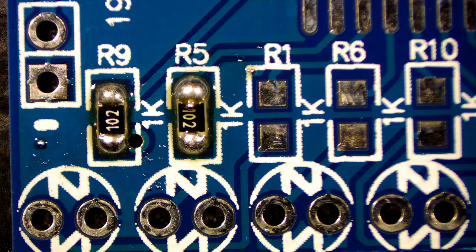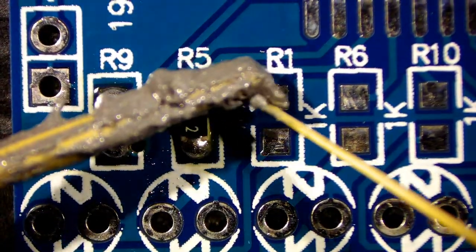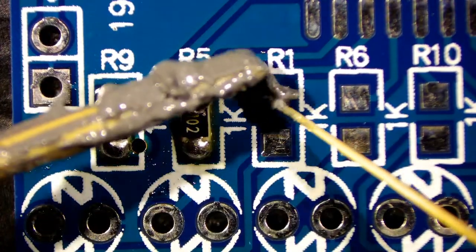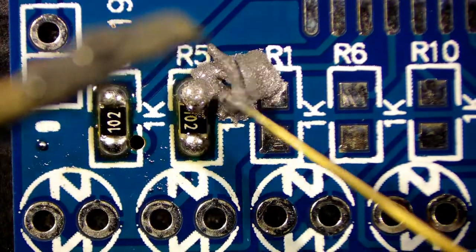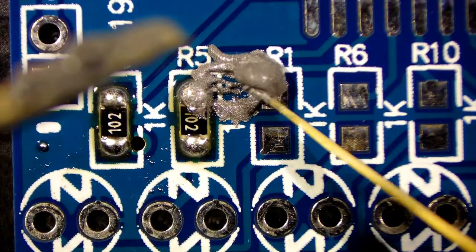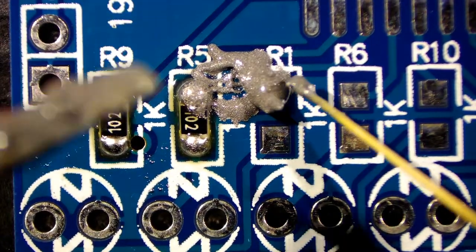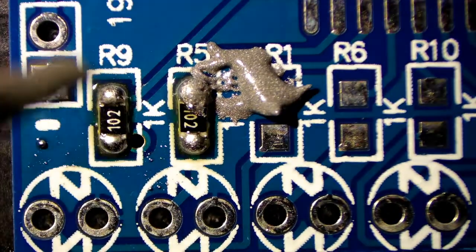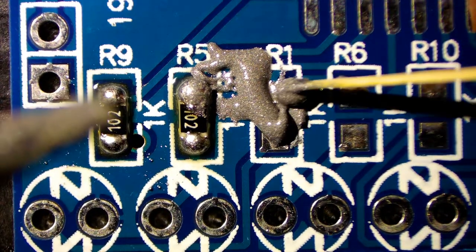The board's got a little bit of heat on it now, so the solder paste will be a bit more gooey and liquidy and spread out. There's not much you can really do about it spreading out. Even when I've used syringes to pipe this stuff out, because there's still residual pressure after you take your thumb off the plunger, you still get too much solder paste going onto the board. It looks messy. It is messy.